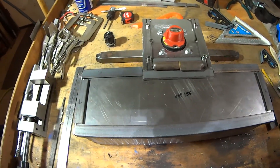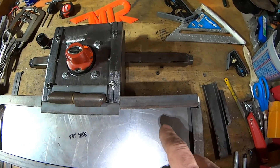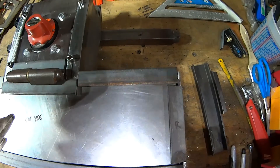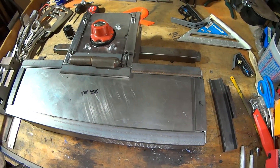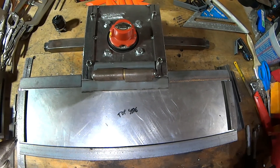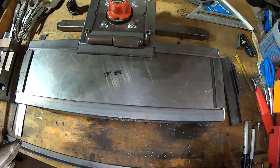A couple of things I wanted to share before going further — why I choose to grind all this metal before I weld it. As you can see, this angle iron is ground and this one is not. That's what we call mill scale. Paint does not stick to mill scale despite what anybody says — grind it off. It's easier to weld, easier to handle — everything from beginning to end becomes easier if it's cleaned. Same thing with the sheet metal.